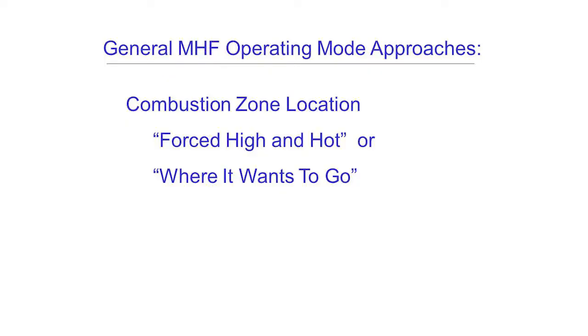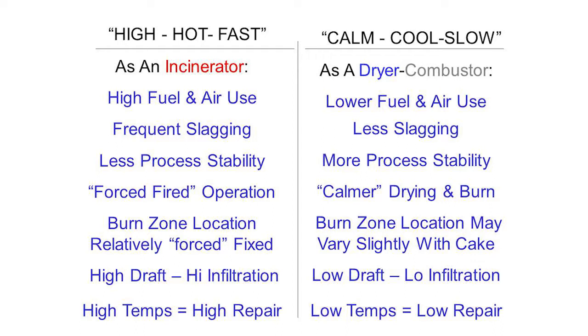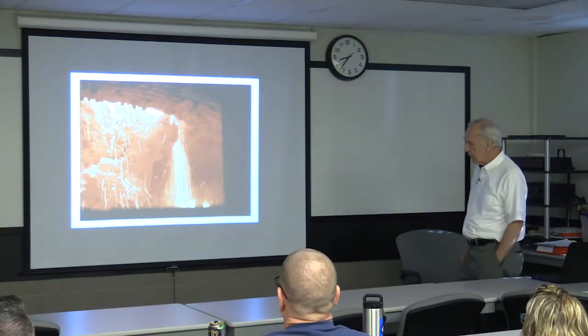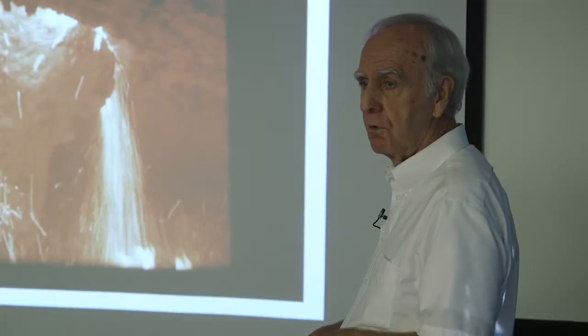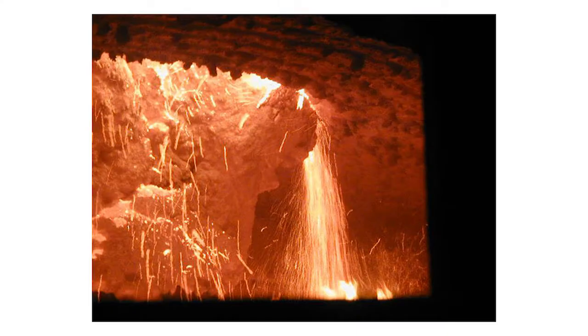Going around the country you generally find two categories of operation: what we call the blast furnace sort of operation — too many burners, force firing — and facilities that are letting the furnace drying section do the work, bringing it down as cool as possible and letting it take off. Here's an example looking from hearth four into the inner ring of hearth three showing slag buildup on the center shaft — it was rubbing and sparking in three places and when they shut it off it froze. This shows what can happen over time when you're firing burners in the burn zone, with the hot burner flame catching the ash and plastering it against the shaft or the rabble arms.